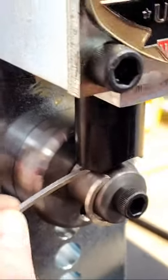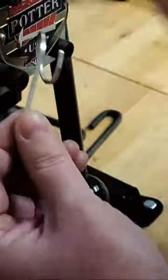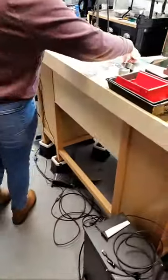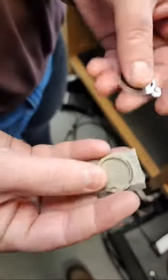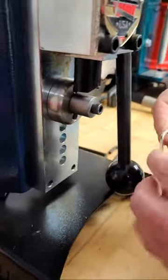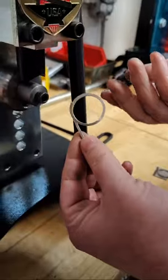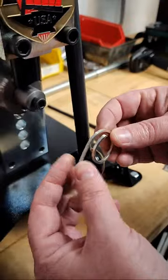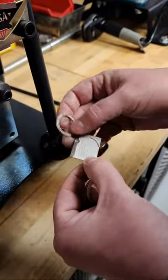As she's feeding it through, she's making sure the wire stays flat against the former and isn't twisting. You could keep going and make a coil to get two frames the exact same size. Then go in with a jeweler's saw and cut to prepare for soldering — it'll be a butt joint, cut through the join, make sure it's a tight fit, and solder it together with hard solder.